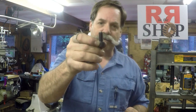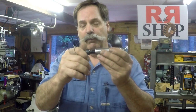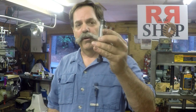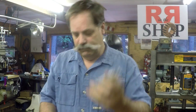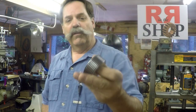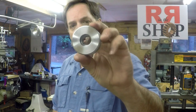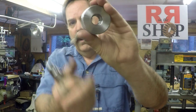We're going to use a half-inch 13 socket head cap screw as a draw bolt that goes in there and pulls it in, holding it nice and snug inside the taper bore so it won't turn or get loose. That's the draw bolt. I've also made one of the adapters already - this one is two and a quarter by eight on the outside and three-quarter ten with a register bore on the inside.